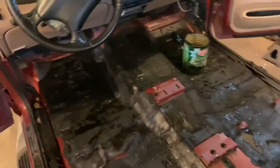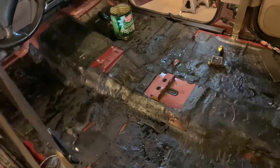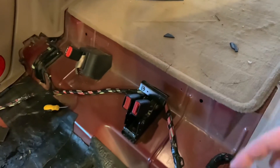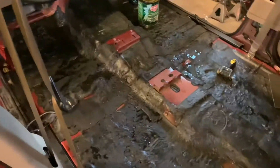So far I've got one full layer. There are a couple spots I haven't put deadener in yet because I still need to test-fit — this spot right here because the center console actually slides into place. But everywhere else has a single layer of deadener. I'm actually doing a different deadener back here — I'm going to be doing the Death Bond double rigid — so that's why I haven't messed with that area yet.